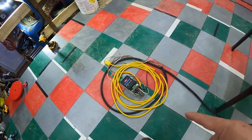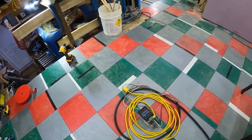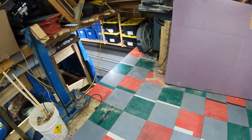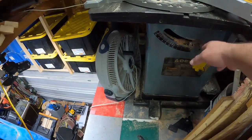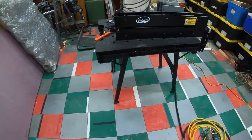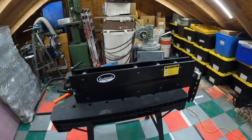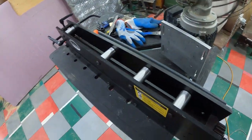If anyone's interested in tutorials on how to do that, I've got around four or five tools like my Delta table saw — it's a five-horsepower three-phase motor I converted with a VFD — a mill downstairs, a dust collector that's three-phase, and a few other things.